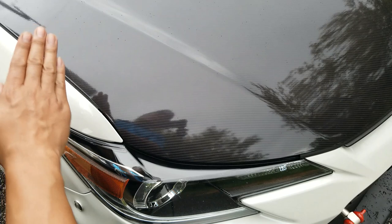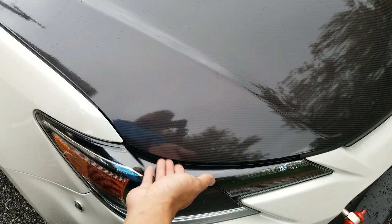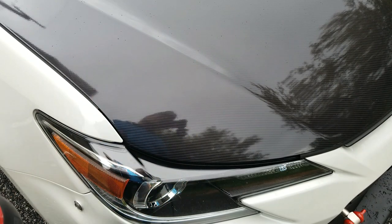That's the importance of why you need to do the post-heating. When it gets cold out, the vinyl will revert back to its normal shape. Remember, 90 degrees Celsius will make the vinyl lose its memory. Thanks for watching.